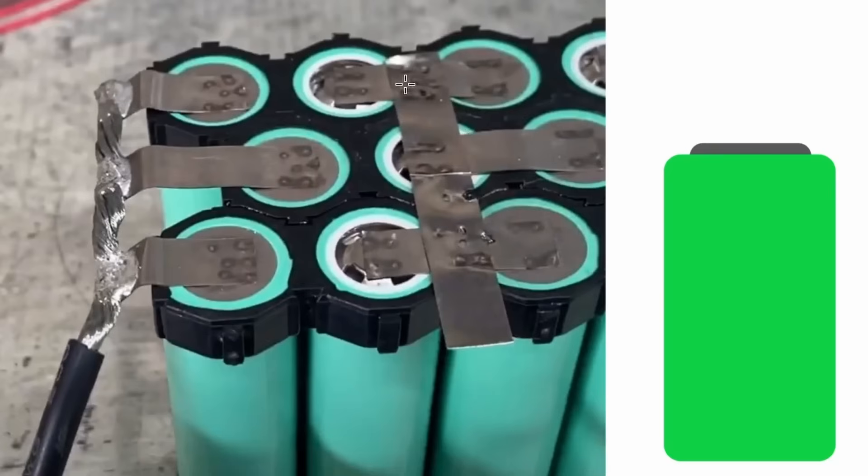The main culprit are these bad spot welds. All I did was lay a piece of nickel across the terminal and then spot weld it. When you do this, all the current goes from this lead, through the nickel, and out the other lead. This just heats up the nickel — it doesn't really heat up the cell — and gives you a bad spot weld.